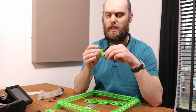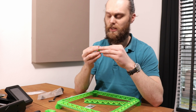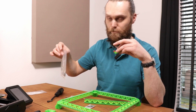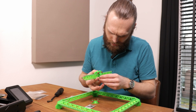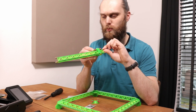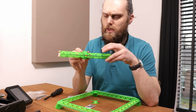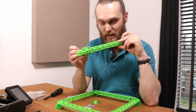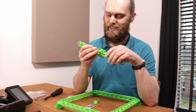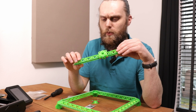I've printed the wheels out of ABS with a 0.2 millimeter nozzle and tightened them — they roll very smooth. I think the combination of seal washers and bearings is a nice one. I don't know if this is common practice, but it works pretty well. After moving it back and forth a couple of times, it's still not as smooth as I was hoping, but it is sort of smooth. I'm going to be completely honest with you — besides this not going as smooth as I hoped, it fits so well within the threaded rod that individual segments get left behind within the thread. This is not a good solution, however I do have another idea in mind which I will show you a bit later.